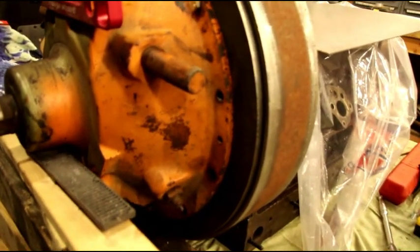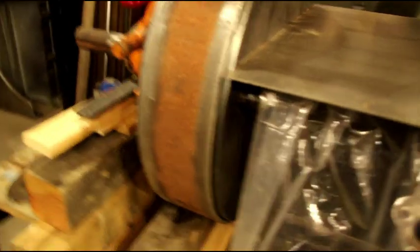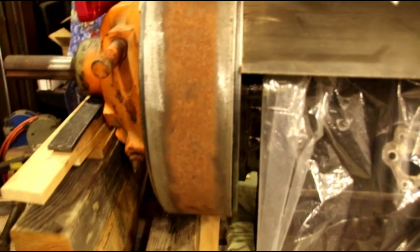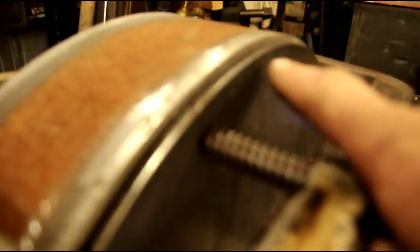I don't know how many guys have been following along, but I have the 3/4 inch plate ring here, and I have our new plate made for the back of the engine there. And then I just rolled up a piece of 5/16 stock. I had a piece 4-inch wide, and that's the perfect width. So what I'm going to do now is start tacking it.